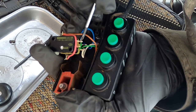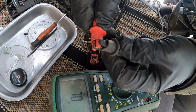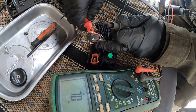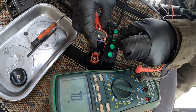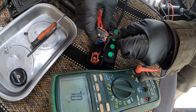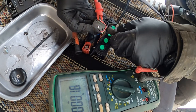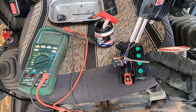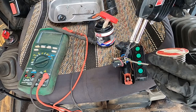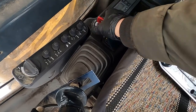That caused an intermittent issue with the closing grapple. Let's check the continuity and the ohm resistance. I set my multimeter to resistance — I'm looking for resistance under one ohm. We have 0.3, which is good, and the other one is 0.115, which is perfect. Let's solder that connection.